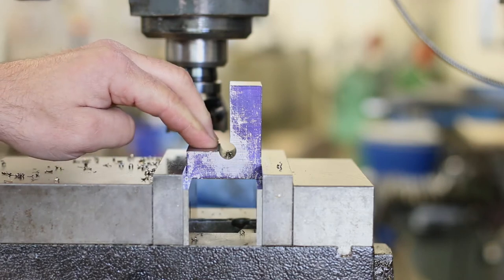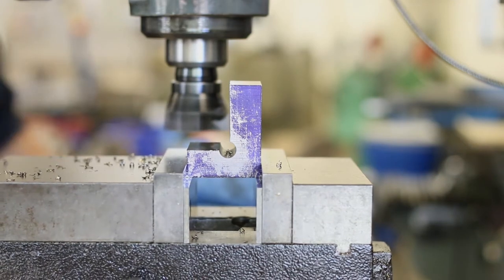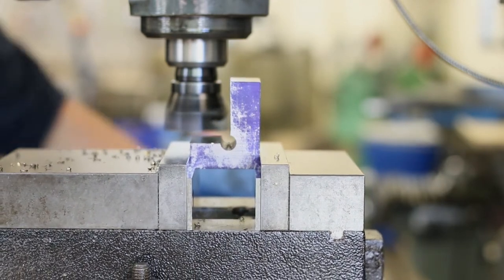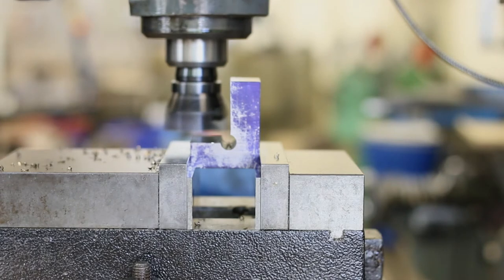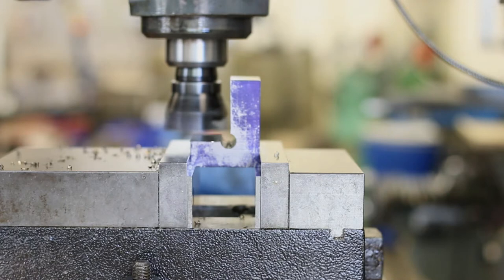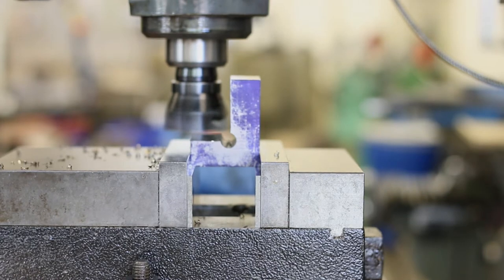This dimension from the bottom of the hole to this surface is going to be 500 thousandths when done. We left about 15 thousandths on this surface, so 500 plus 15 is 515, plus another 15 for the top surface gets us to 530 thousandths. If we cut this dimension to 530 thousandths, we should be about 15 thousandths over that hole. Going from 720 to 530, that's 190 thousandths to take off. I'm only going to go about 50 at a time with this cutter, so that's going to be about four cuts. First cut of 50 thou — I'm going to go to the 70 on the dial.